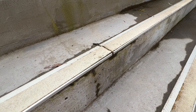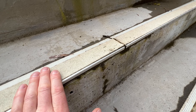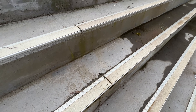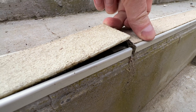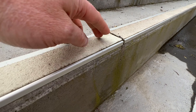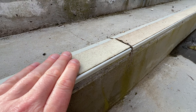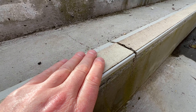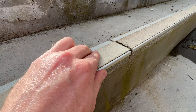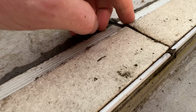It's non-compliant because it has to be a single unit — they have to be connected and fit for purpose and safe in the design. This is not safe in its design. They're all coming off. It could be a water problem, it could be a heat problem — who knows. The adhesive used to put this piece down onto the aluminium could be an active adhesive, like a double-sided tape. Double-sided tapes remain active — they never actually bond the two surfaces and don't tend to work well outside. This is a real shame.